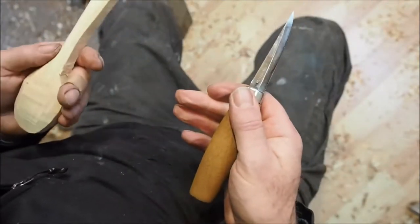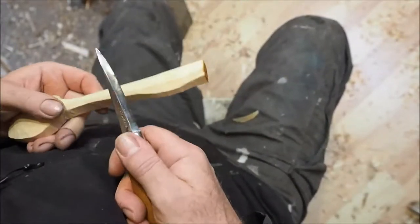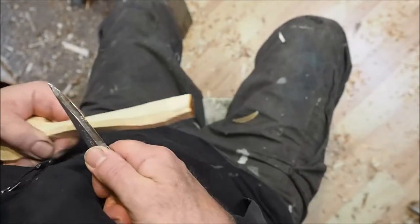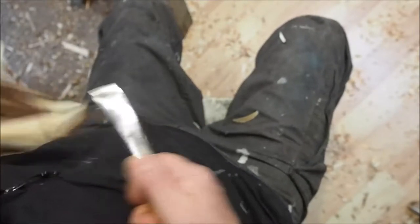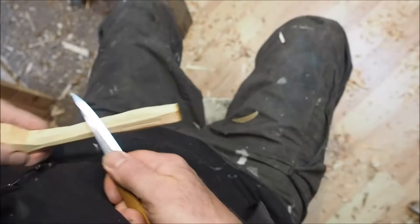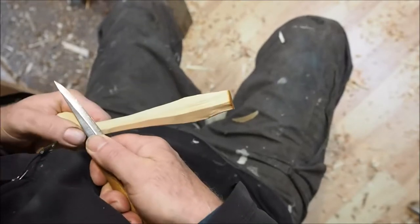There's a variation on this, where you're simply bracing the knife against the rib cage here, pushing the thumb down onto that surface you've established and pulling the workpiece past it. And I go back, yeah? The bevel runs flat on that surface I've created, and you bring it along and you're creating this lovely flat plane surface where I wasn't quite getting the edge engaged there. So you're not tilting it up, you're running back along the surface.